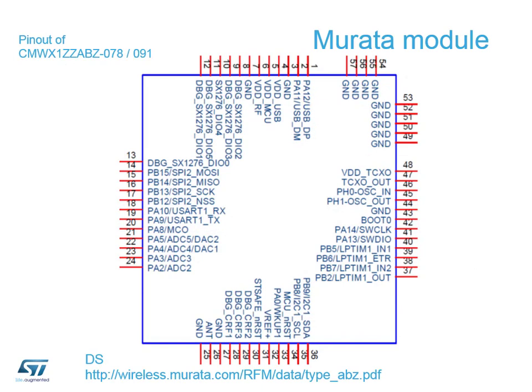All the other pins on the STM32 are bonded to external pins on the module. Looking at the module, you can see that all the pins are available for you to use in your application. You have pretty much every peripheral on the STM32 available — all the timers, ADC, SPI2, some debug functions, I2C1 — everything is bonded to the pins so you can generate a full application using the STM32 L0.